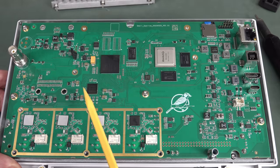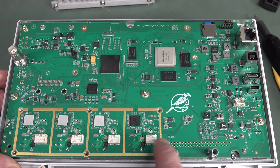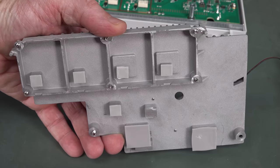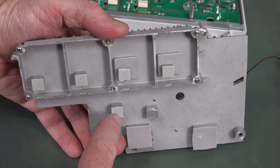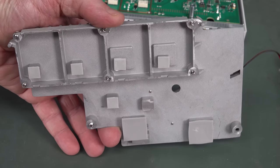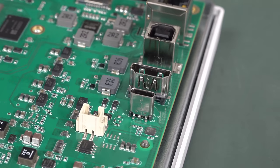There is some RAM missing, as I said. We've got the heatsink which covers everything. We'll see if it's the same — and we'll see if the Rigol custom chip is the same on the front end. They've only got the one relay there. So it does look quite different. But it's crazy that that whole front end is only 100 megahertz. On the back of the heatsink, we've just got large thermal pads going onto the die-cast block. The four front ends, the analog-to-digital converter, the main FPGA, and the Rockchip processor running Android are all in there.